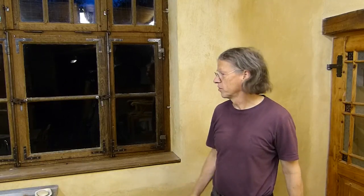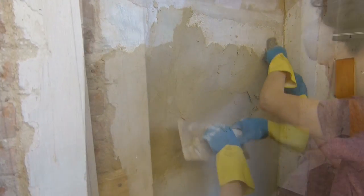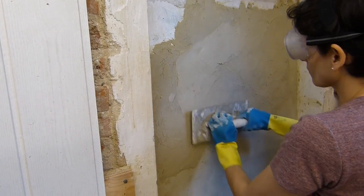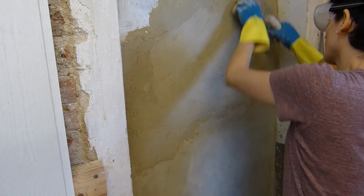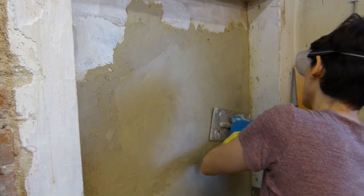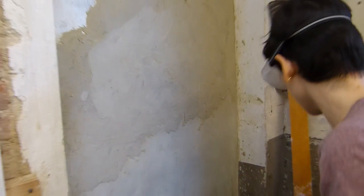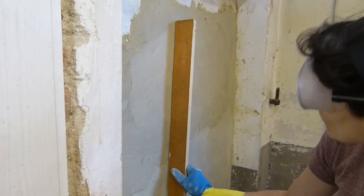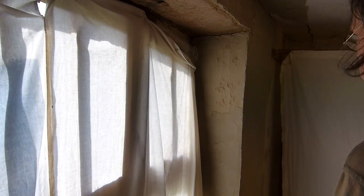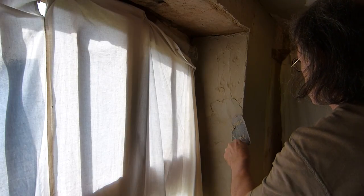This alternative technique was hit upon when someone new in the shop, instead of throwing the plaster at the wall, decided to press a relatively dry plaster into the wall, compact it with a lot of force, and also apply a lot of pressure when smoothing it with the finishing trowel. This particular batch happened to contain animal hair in addition to the typical ingredients of slaked lime, sand, and water, but it was still a much better result than had been seen previously with the technique of throwing a wet plaster at the wall and smoothing without expressly compacting it.